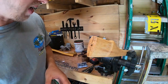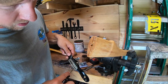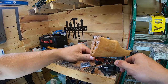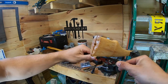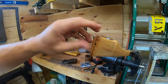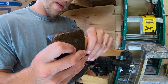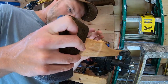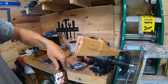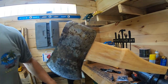We're going to use our spoke shave for this — just to get a little extra fitting done. You can also use a draw knife. Don't go crazy; this will take off a fair amount of material even with light passes. Just knock that edge off there and we're almost already there.